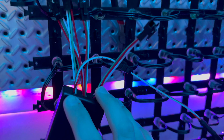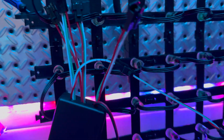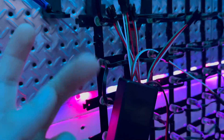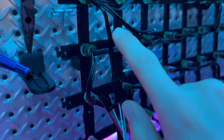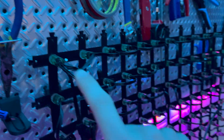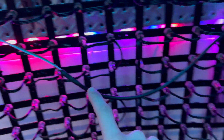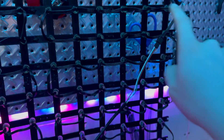This is one of the LED controllers that I make custom myself. Here are the five outputs it supports, and here is the power connector for five-volt power going into it to power the controller and the LEDs. Right here we are feeding the primary data line from output four of the controller, feeding the LEDs down, back, and around all the way down.